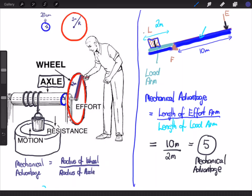The radius of the wheel, let's say in this particular instance, is 2 meters. Now I want that in centimeters so the units are the same. So 2 meters is in fact 200 centimeters. And let's say the radius of the axle, we said, was 20 centimeters. Now 200 divided by 20 is the same as 20 divided by 2, which is 10. That gives us a mechanical advantage of 10, which means with this arrangement,